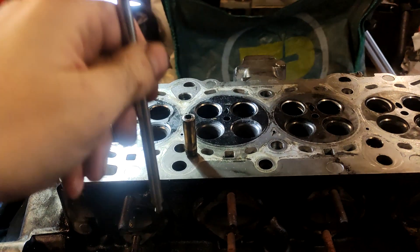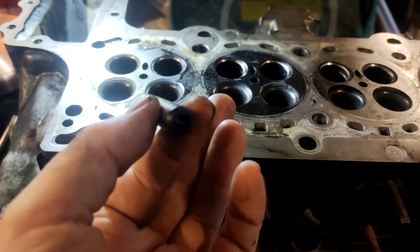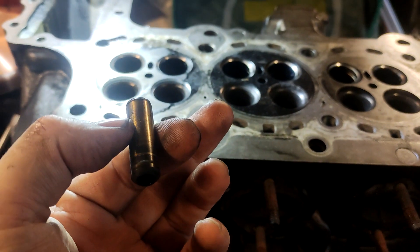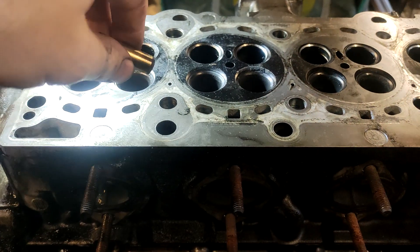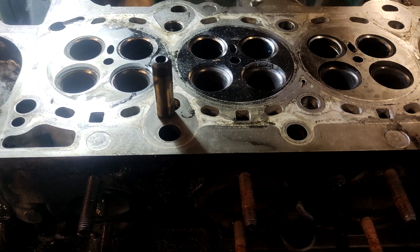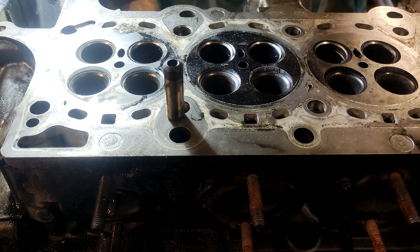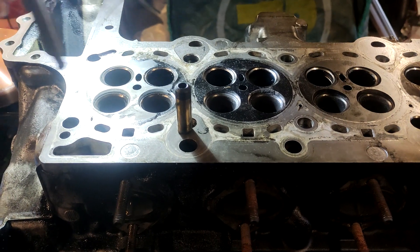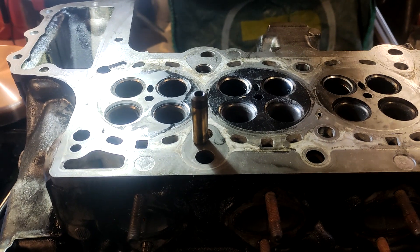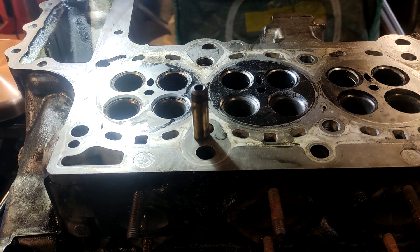They come out that way but they are quite thick. What I'm going to do now is tap the top with an M8 thread, put it in the vise, then thread some bolt or threaded bar in there and try to pull it out using the vise. If that works, I'll move on to doing the rest of them in the head that way. I'm not comfortable just hitting it with a massive hammer all the time — tapping takes a while but if it works better, then we'll see.